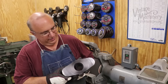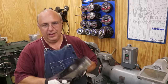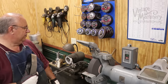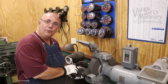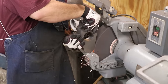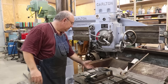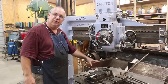Now that we've got this thing band-sawed out, I'm going to smooth everything up and blend all these rough-sawn edges together and get everything down to size. To do that, we're going to go over to the big Baldor grinder — it's a big five-horsepower grinder with about fourteen-inch wheels and a nice wide face, about a two-inch-wide wheel, which is wide enough to handle this inch-and-a-half stock. We got our part all ground up on the edges now. It's not 100% — I'll probably go back and touch up some more when we get through with the rest of the machine work — but it's good enough for right now.